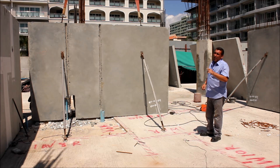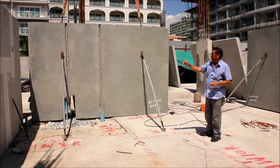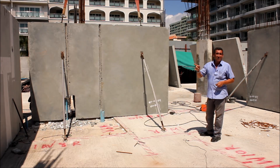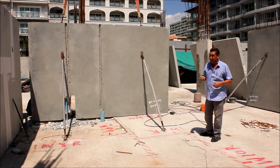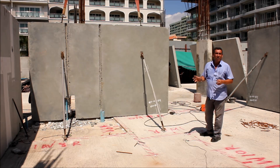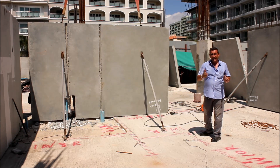The first walls that go into position are the 15cm walls which make the perimeter of the entire apartment. These are 15cm thick with the largest amount of foam in the middle, and these are the ones that make sure you can't listen to your next door neighbour's television or whatever they're going on with. We work from the outside inwards.